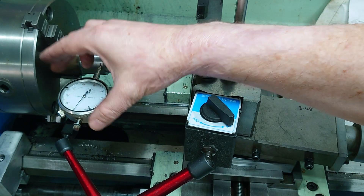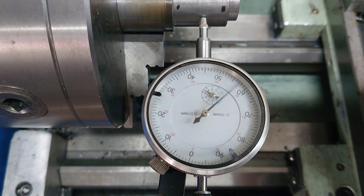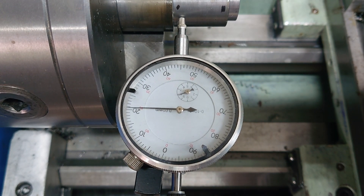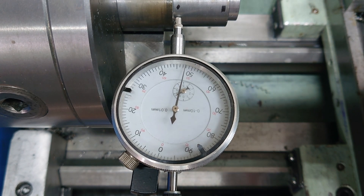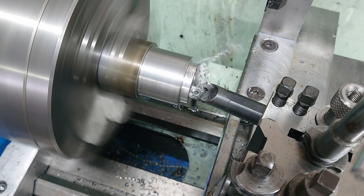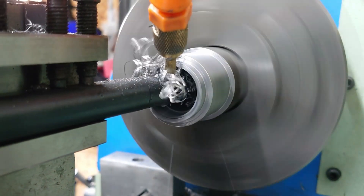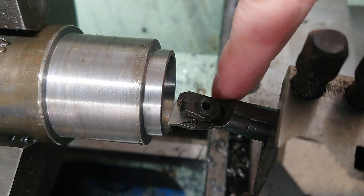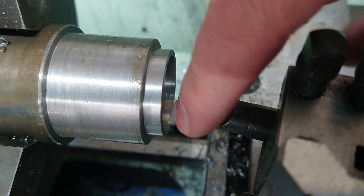After much fiddling about, I think we're basically there. That's exactly 25 — we're just a shade under 3.48. That'll have to do. Just switched to this TPAN-style boring tool. It's got a slightly larger nose radius and I'm getting a better surface finish on the inside, so I'm just going to do the last couple of passes with this one.